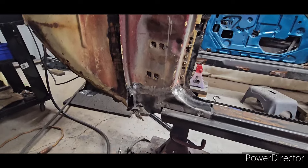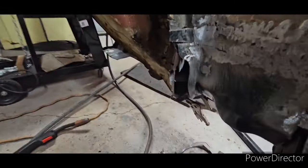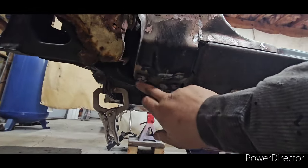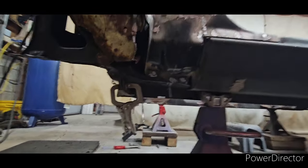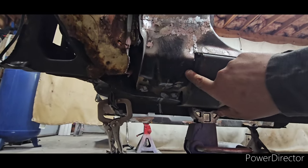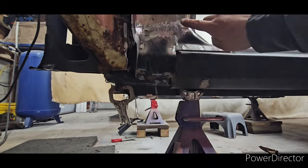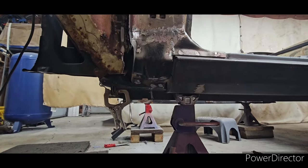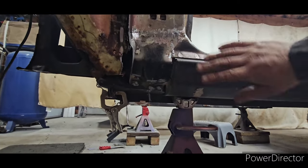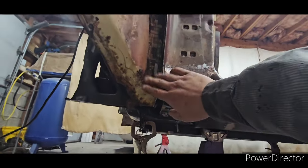The repair here is done — your lower door jamb. You can buy this panel. You will have two plug welds here and a plug weld there. Make sure she fits nice and tight. You're going to have a little gap here which is from factory. I have one more plug weld to go — I have to drill a hole there — but she's pretty much in. I already did some grinding. Any little pinholes I can visually see I'll hit again with the welder. Anything I cannot see I will fill with a little waterproof fiberglass filler and sand it down. I just need to do a repair to the lower cowl as well.